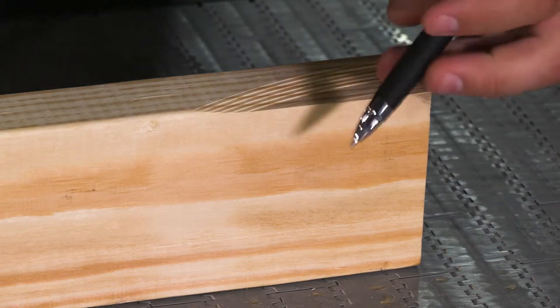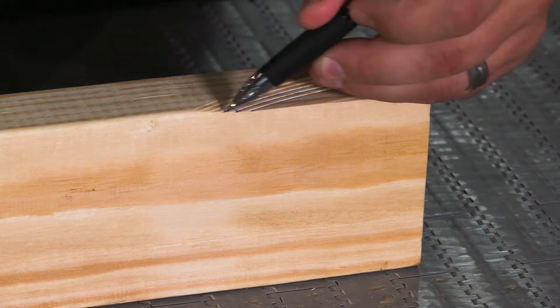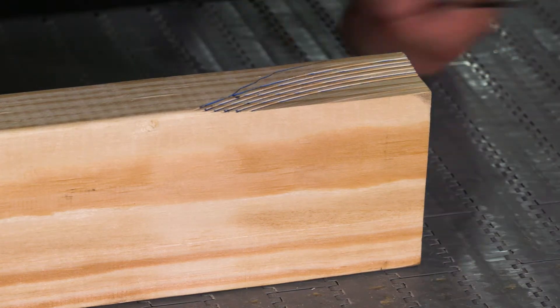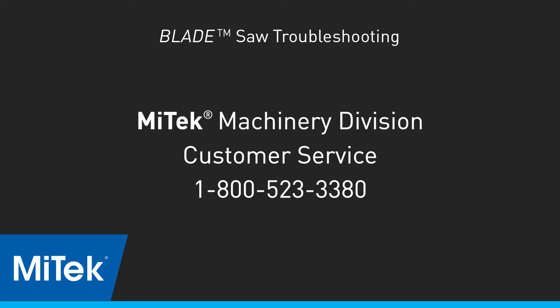This will make a complete semi-circle in the bottom of the board, ranging from one end to the other. In this case, we can see that there are six full complete semi-circles by tracing them with an ink pen. Once we count these cuts, we will enter them on the touchscreen where it's labeled 0 through 10. If the reading is 0 or 10, we will enter 0 or 10 on the touchscreen and rerun the calibration. You may want to compare the original and new numbers on the final value screen, just to be aware if you're having the same problem over and over again. If so, determine the mechanical cause and fix it.